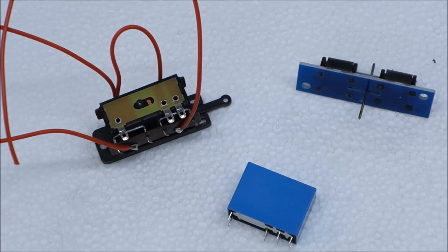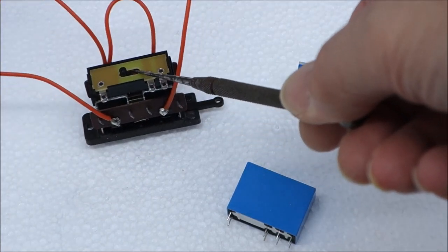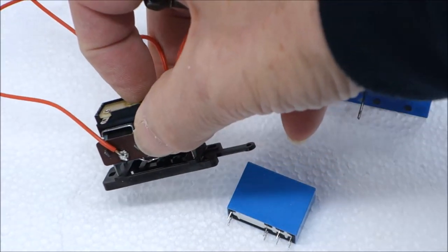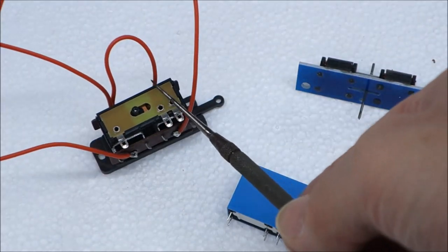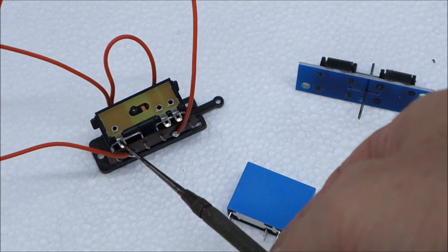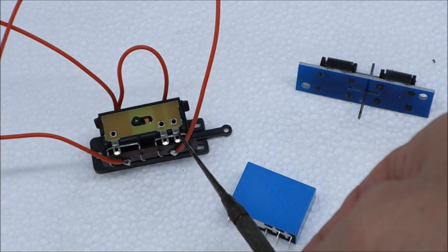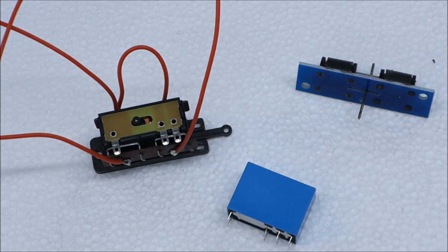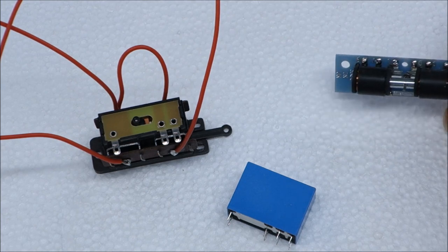And here are three options. You've got a Peco point motor or similar that's got a PL13 switch on the top. So as the point motor changes, this switch changes, and you can see that if you connect the frog to that connection there, and then you either have the positive or negative rail connected to those two, you can see that that switch will change the polarity of the frog. This is a Seep point motor that has a switch built in.